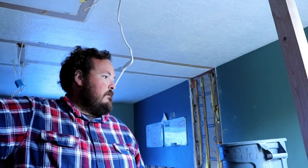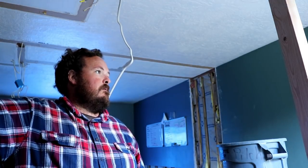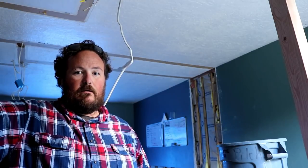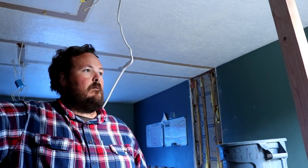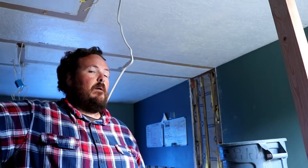Another great day. I think we've got our shopping list together — we'll head out and get lumber first thing in the morning and start putting that window bay back together. We'll be thinking about anything special we need, like window flashing and silicone. I definitely want to put flex seal underneath the windows. The problem with that flex seal stuff is it comes in those big rolls — there's like 100 feet in those rolls, but those rolls are like $200 a piece.